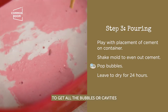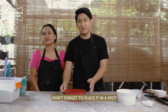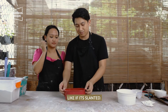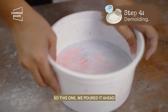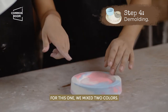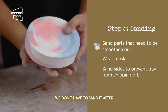We vibrate the mold to get all the bubbles and cavities out of the concrete. After that, leave it for 24 hours — don't forget to place it on a really flat surface so it comes out even. After 24 hours, this one was poured earlier so it's already cured. For this one we mixed two colors. Because we smoothed the surface before pouring, we don't have to sand it after, which eliminates that part of the process.